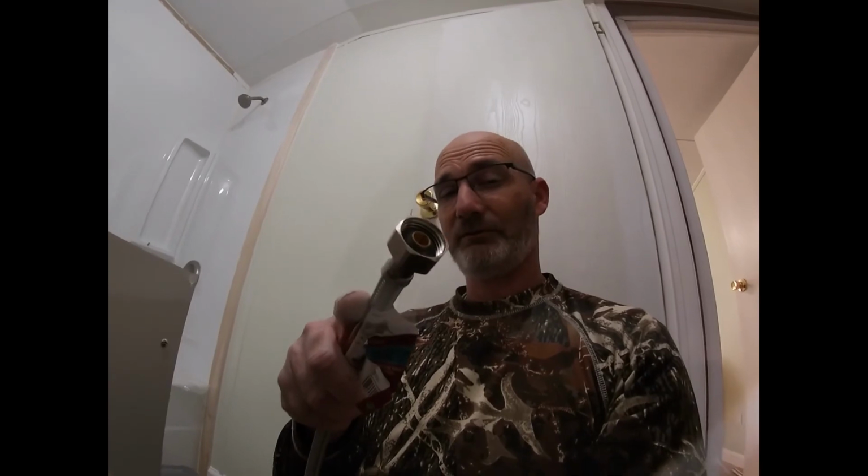What you have on these is a 1/2 inch, which is standard for a faucet, to a 3/8, which is pretty much standard for a shut-off valve. There can be some differences in those. We're going to do these as well as hook up the S-trap, which is going to be your drain going down here. Now, if it's coming up through the floor, you need an S-trap. I hope you can see that in there pretty good.